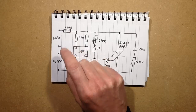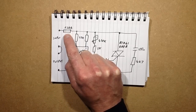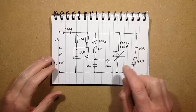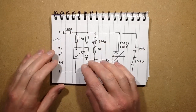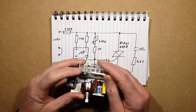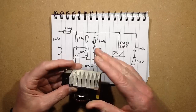It does have a quick-blow fuse rated at 10 amps. Although the eBay listing states 4kW - which would be 16 amps - 10 amps sounds more realistic, because that's going to give a quite modest heat dissipation from this heatsink. Typically you get about a watt dissipated per amp when you're using a triac to switch, so the heatsinks can get quite hot.